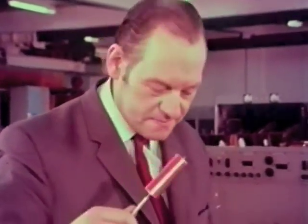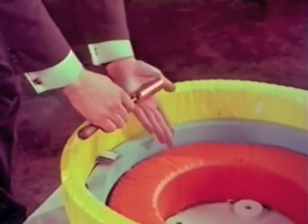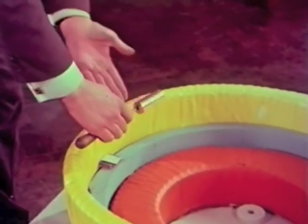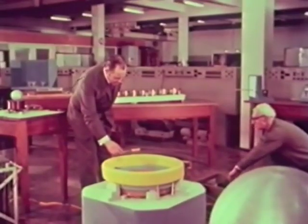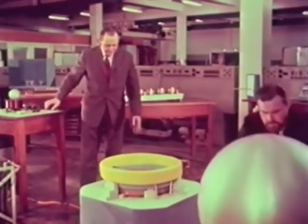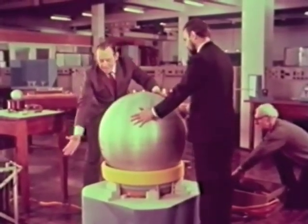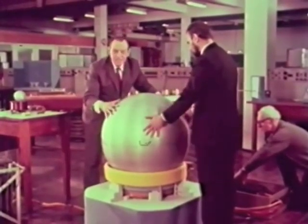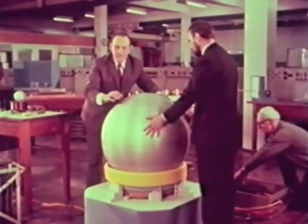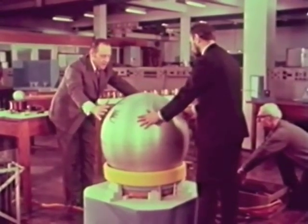It isn't stable with a single coil. Could you connect the other coil please, Jim? Now I'm going to check the phase sequence of the two coils using the rotatable cylinder. What I want is the magnetic field to go down the outside of the cylinder and rotate it in that direction — I want to see it spinning that way. Switch on, Jim. That is the correct direction. Now Barry, if you could have the ball please — this time it shouldn't drift off. You should be able to see the magnetic flux spraying off the sides like the water from the ping-pong ball. It might even spin for us. Ready Jim — three, two, one, on.